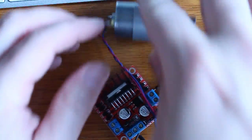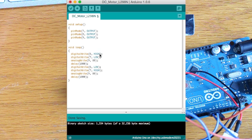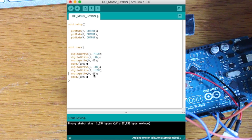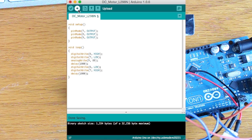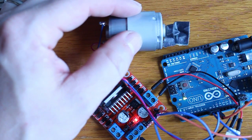I'm going to keep the battery pack off to test — we've got power. I'll put the motor up here where we can see it and run the program. As you can see, the program is very simple — no includes. We do a digital write high on eight and low on seven for one direction, with seven and eight being the direction pins. We set a fairly slow speed on pin nine for pulse width modulation. Let's upload the sketch, then turn on the motor control. As you can see, every second it alternates direction.